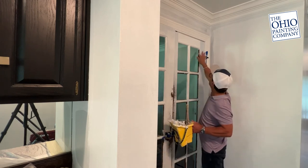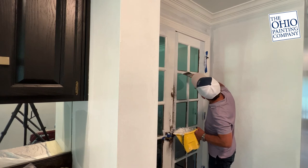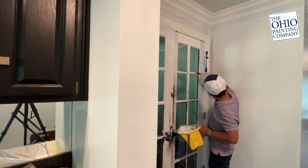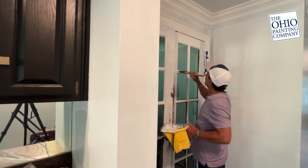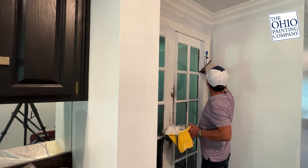One thing to keep in mind is if you do get any on the glass, just take your finger, a rag with a five-way, whatever you need to do, and square that off so that you don't have paint on the glass. Whatever pattern you choose to do is fine — just make sure you don't deviate from it. That way you know for sure you're gonna have the success that you want, and not the skippers that you don't want. Because if you start randomly going around and painting these squares without a pattern, I'm gonna guess that one of these is gonna be left, or one of those is gonna be left. This is the best way to get a really good response from the paint as far as time.